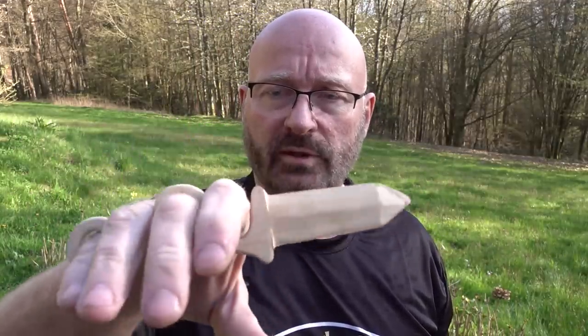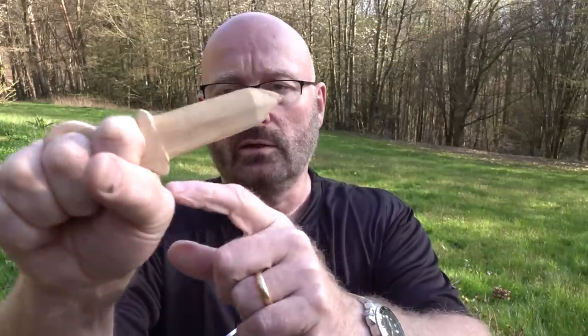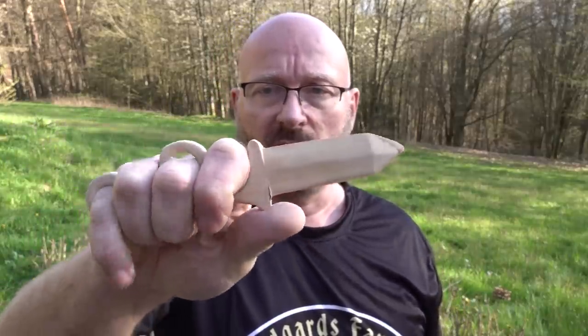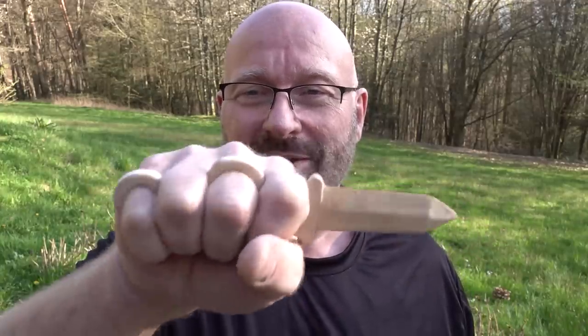I would still make a few more iterations. First, I want to add a ricasso so I can press my thumb against it for carving work, since right now it's a little uncomfortable. I also want to make it more pronounced so it rests against the webbing between my thumb and index finger. I'm also not happy with the blade angle — it needs to be angled a little more. I'll make a few more iterations in wood, then give it to Midgard Knives. Dirk says he can easily make a prototype using his water cutter, then grinding and hardening it. Hopefully very soon I'll be able to show this in steel.